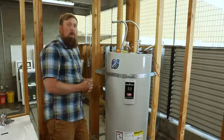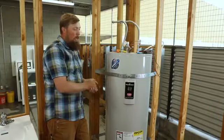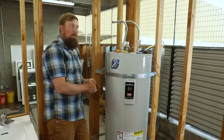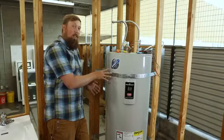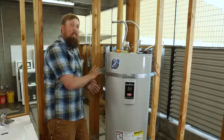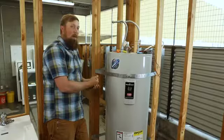The life of a water heater is generally between 10 and 15 years. If the tank itself is damaged or leaking, it's usually just a replacement. Most parts can be replaced, but you get to a point where you're adding more money to it than it's worth. After about 15 years, you want to look at replacing it — that range is usually between $1,000 and $1,200. For students wanting to tackle your water heaters at home: ask your parents' permission first, make sure you're safe, make sure somebody's supervising you, and make sure the power's off. If replacing an element doesn't do the trick, it's probably time to call a plumber.